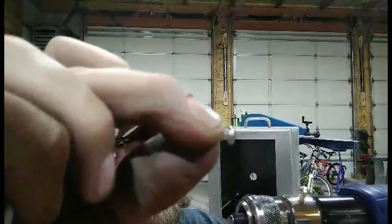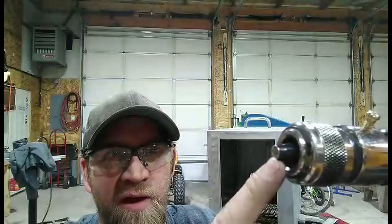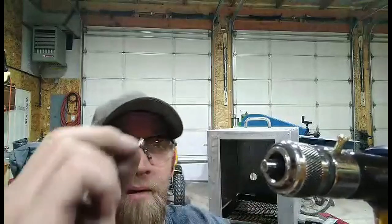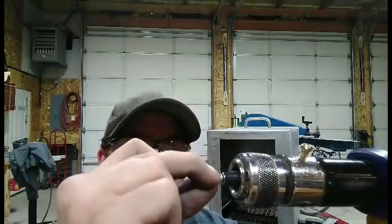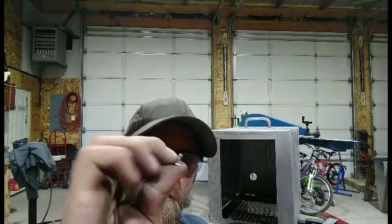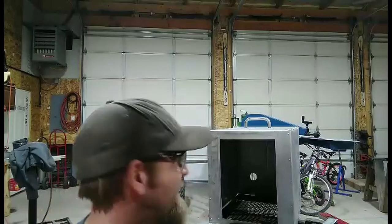You can see the ends of them are like a button. Then you have your anvil that goes inside. I'm using an air chisel is what I'm using. I think they make actual ones that are lower RPM for these exact rivets. But as you can see, they fit down in there. It actually cups that rivet. So when you drive it in, it'll smash down the round side, sorry, the stud part of the rivet and pinch the two pieces of metal together. As you can see, you've kind of put a couple in here.